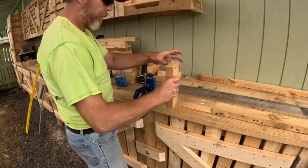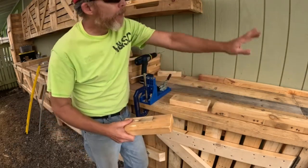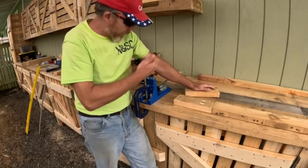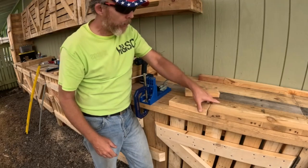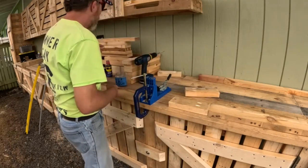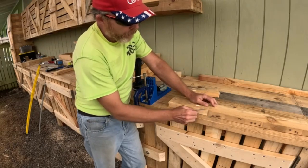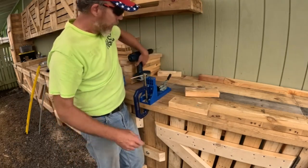And that, neighbor, is pretty much it. I've already done a lot of these because on our end frame it's not quite tall enough — we need another nine inches to get to the height. Now, if you don't have one of these tools, I'm not saying you need to get one. If you didn't have a pocket hole jig, you can always pre-drill with a smaller bit, make a pilot hole at a 45, then take your screw and enter it that way. That's a pretty good joint. But with these, the screws are just going to go in just like so.